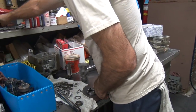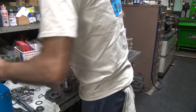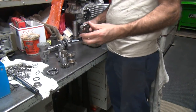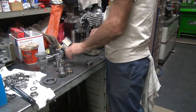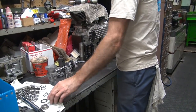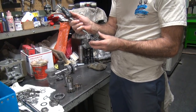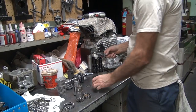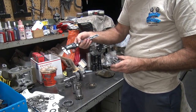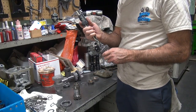Now you start comparing things against known pieces and look for discrepancies, huh? You got it. Something's not right. I'm going to go to number one thing: 840, 860, so that's thicker than stock. So that's not the problem. Next thing is the depth of this. That ain't it. So that leaves just this, which is the difference here, which we already know is different.